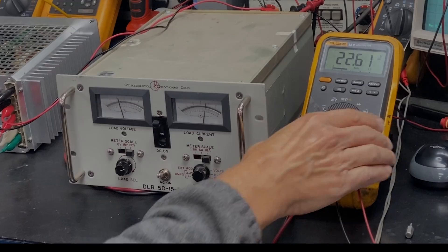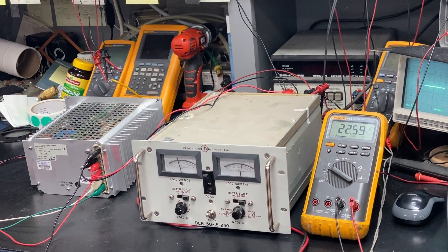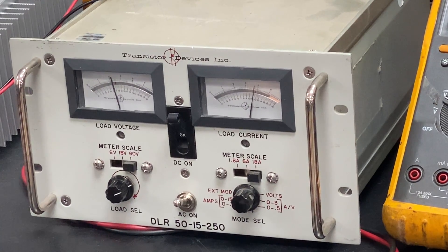At this point, you may have noticed that the voltage dropped. Voltage falloff is a common problem that you can have out in the plant, especially when you have 50 feet of cable being routed to your load device. As such, a lot of suppliers will offer a feedback circuit to circumvent this issue.